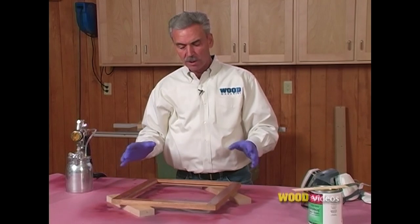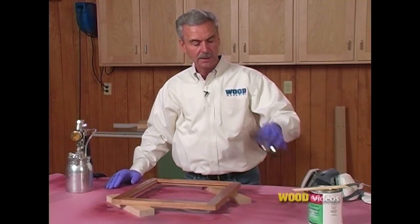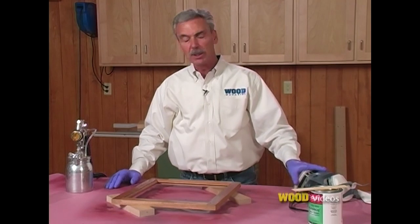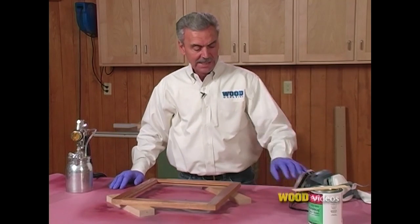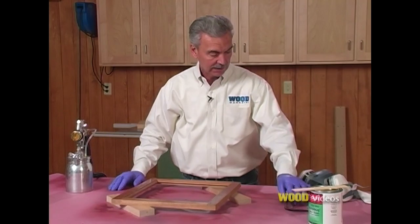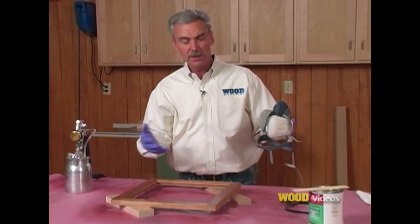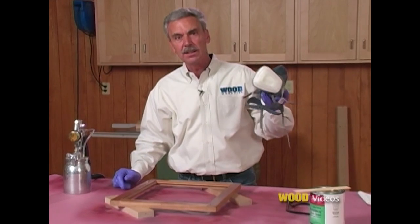Well, this is a time to talk a little bit about what we just got done seeing. You notice that I was wearing goggles, and I'm also wearing a respirator mask, and of course I've got some rubber gloves on. A lot of people feel that goggles are a good idea, and they always are. But I found that a lot of people, especially when they're spraying a water-based finish, water-based poly in this case, feel that respirators don't have to be worn. The fact is that it's still polyurethane, and once the water evaporates away, it's still a polyurethane you're inhaling, so it's always important to have a respirator.